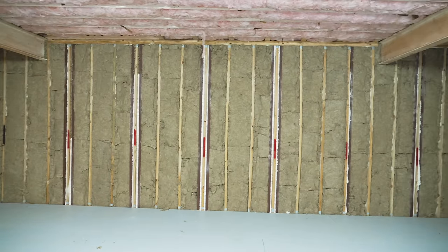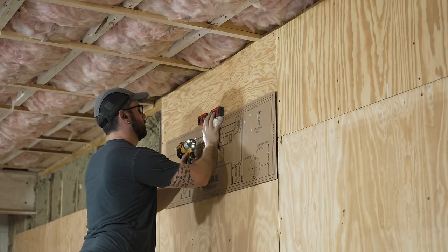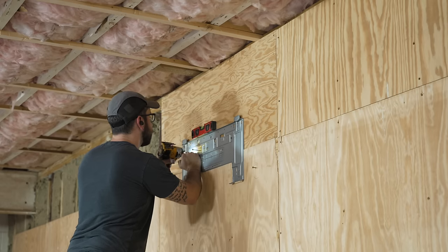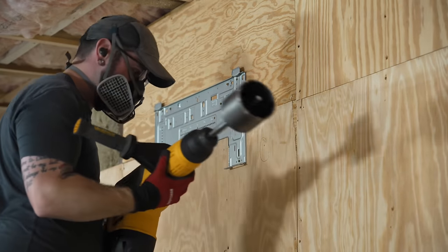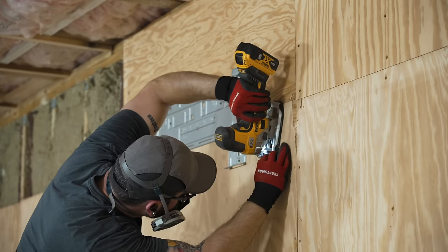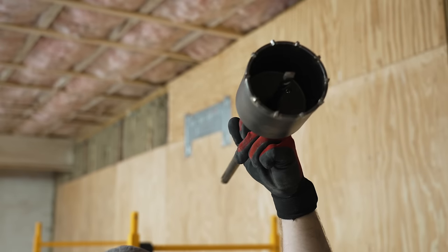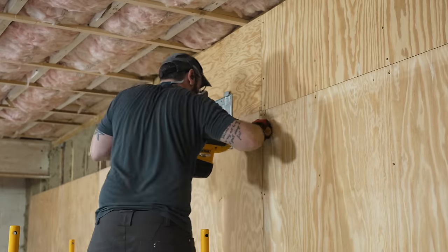With how well insulated the shop is now, this should make for an extremely comfortable and efficient workspace. After unboxing, I figured out where exactly the first indoor unit would be mounted — these units need to be at least six inches below the ceiling, and I factored in where the drop ceilings would end up. After laying out the mounting location and the hole for the line set, I got the mounting bracket installed on the wall, driving a few screws into the studs. Then it was time to drill the giant hole through the wall — I pulled out my SDS Max drill, but the four-inch concrete bit didn't want to cut through the plywood, so I cut the hole with a jigsaw first and got back to drilling. With about 14 inches of wall thickness to drill through — between the 8-inch concrete block and 2x6 wall framing — I needed a super long bit, and was amazed at how cleanly and quickly it drilled the hole.